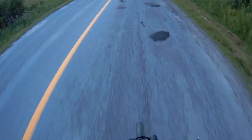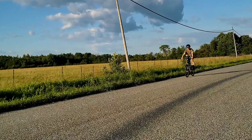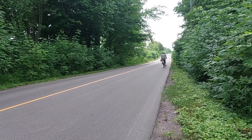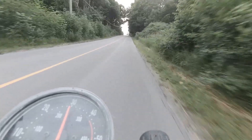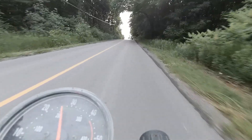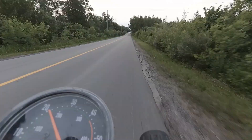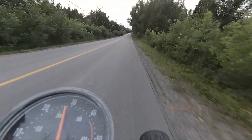We're not on level ground yet. The controller is getting really hot. Checking both batteries, especially the 5200 milliamp-hour one, on a hill climb. Our wires are getting a little warm. I'm backing off. Yeah, so it easily hill climbs. It's about 28 degrees Celsius out, so that's why the controller's not cooling down.